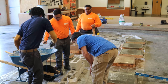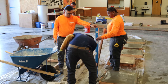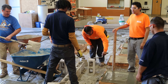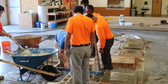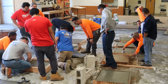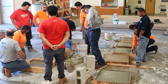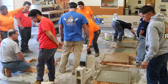Laying block and doing concrete takes a lot of practice to get the mortar on top of the block without making a mess on the side. Now they're plumbing up — this is what you do when building the leads on each end of a wall. You plumb up to whatever height you want to go, get your two ends built at full height, then pull your lines from each course across from end to end and fill in the middle. Once your two ends are plumb, you don't need to plumb anymore. Your leads take the most time, then you just throw fill in the middle and toss the level aside because you have a line coming off two plumb ends.